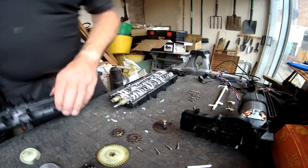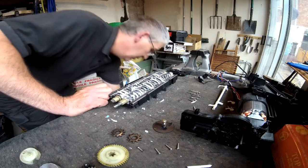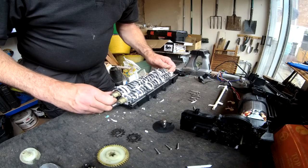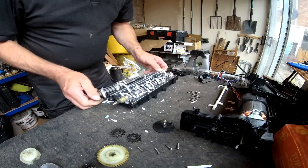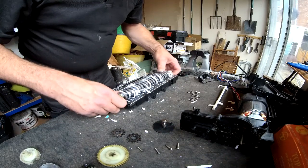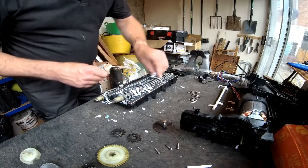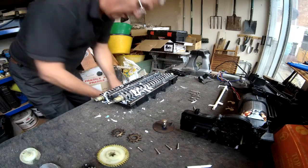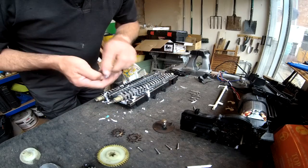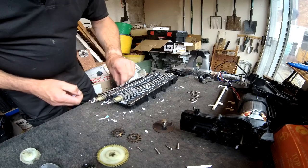And there's the top half off. Pop that there. And now we can see the shredding rollers. Yeah, I think it is. It's just a collection of dust and debris from all the work it's done over the few years we've had it that has collected in between the teeth and the rollers, and it's just got tighter and tighter until it's overloaded that gear and stripped it.